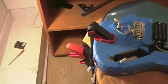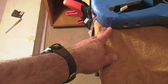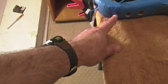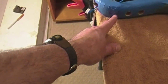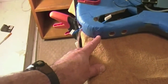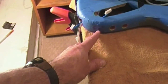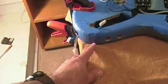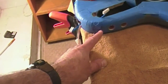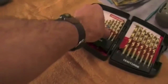I traced the opening like I did before, and then I started by drilling four eighth-inch holes in the corners, and then a pilot hole — an eighth-inch pilot hole — in the middle. Then I enlarged that with my three-eighths-inch bit, which was the largest one in the set. In retrospect, I think I'd probably use two slightly smaller bits than the three-eighths, maybe five-sixteenths, and do them diagonally to just eat up more wood. Anyway, once that was done I put a depth marker on the drill bits.